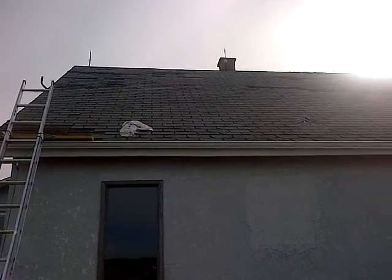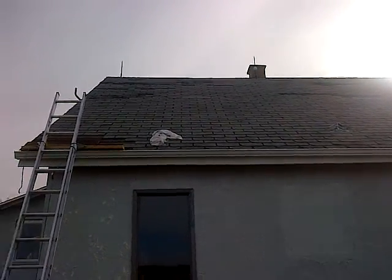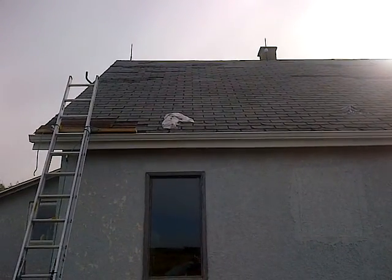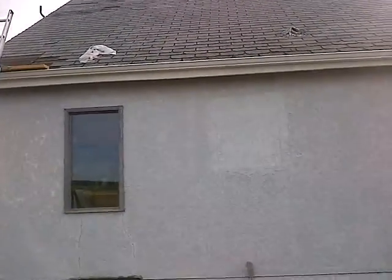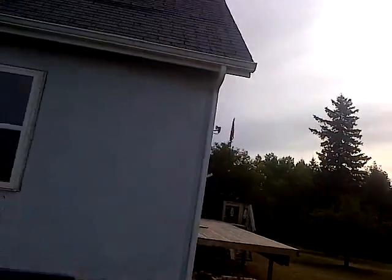Instead of 45, I'm going to straight shingle it. It's easier because I don't have to take the planks in and out. I can just set it up, do one section, and then work my way back down, take them all out and go over and set them back up. So in the next video you'll see it when I've got the first jack and planks in.